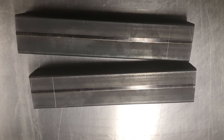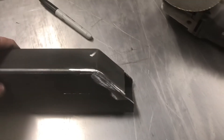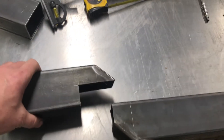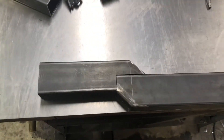Here I have some of my tubes laid out ready to cut. These are two by three by 083 roll. I cut this notch out here and bend the top down and weld it up, and then this is what it'll look like. After notching the one tube like this, put them together like that and I have my step.